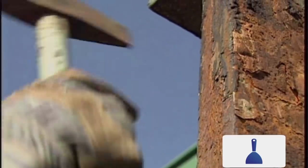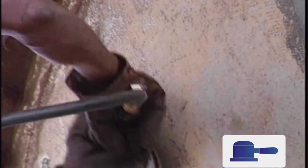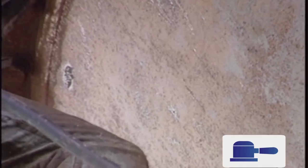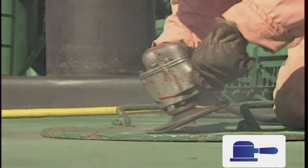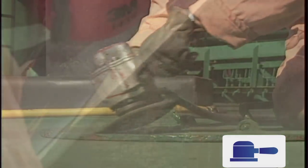The purpose of surface preparation is to remove as much existing corrosion as possible and prepare the remaining coating to produce a surface onto which the paint can firmly stick. The disk sander or power wire brush are ideal for the treatment of corroded areas and create a suitable surface for painting by feathering the edges of the surrounding intact coatings.